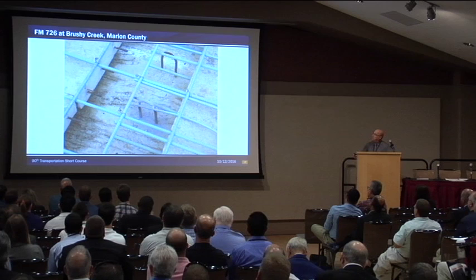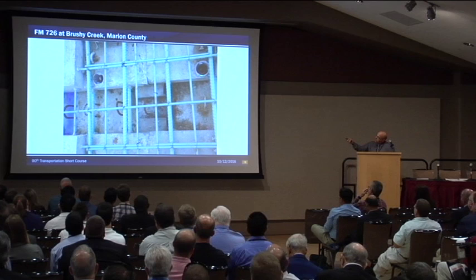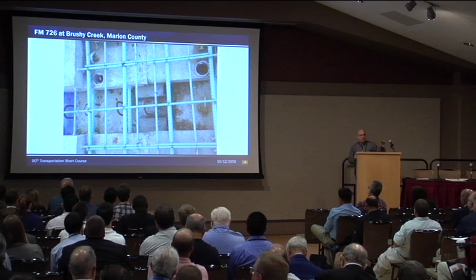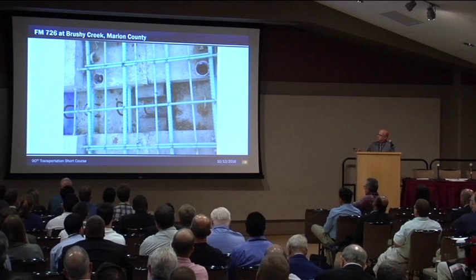This is the Z bar I was talking about — it's welded to the R bar of the girder. That's just to keep that panel from moving adversely or slipping off into the drink. These are the grout pads, the leveling pads. We didn't allow them to use the leveling bolts to keep the panel at the right level — they weren't stiff enough. So they had to find a different way. They could either use the grout pads or whatever method they chose, as long as it didn't adversely affect the system.